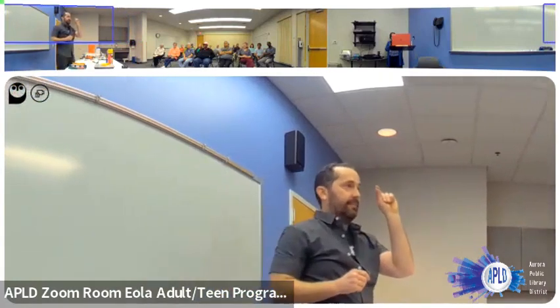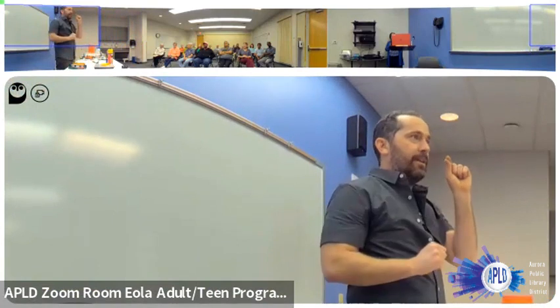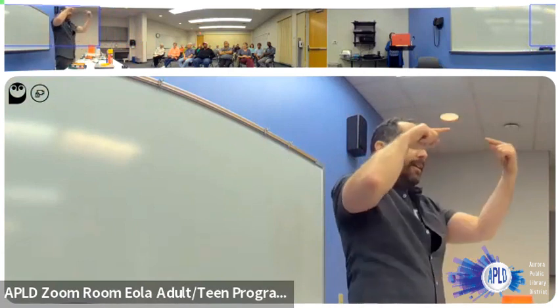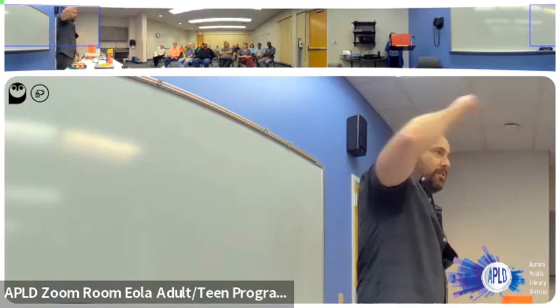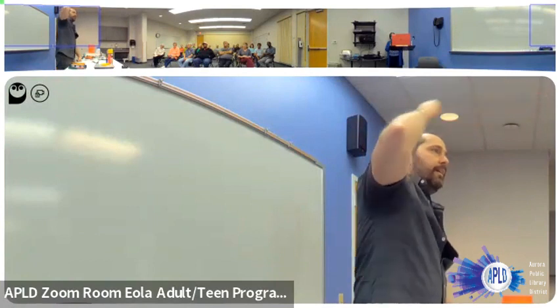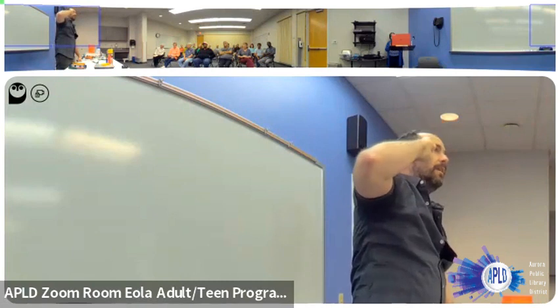Take a pencil and a little piece of sandpaper and glue it to the eraser and stick it right down the center where, if you look at a light bulb, it's got the metal screw and then a little metal dot at the end. Where that metal dot touches, that's where the electricity comes in. Especially in a bathroom where it's steamy sometimes, if that gets corroded, it'll mess it up, especially an LED, because it needs clean power to operate successfully.